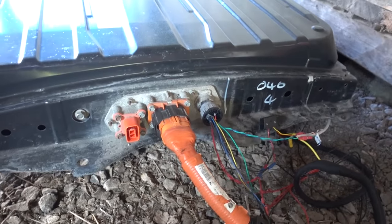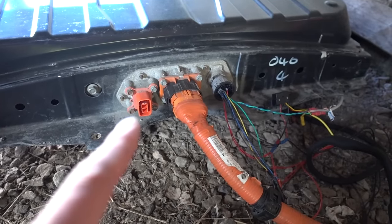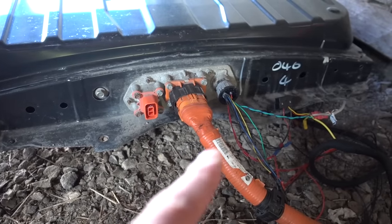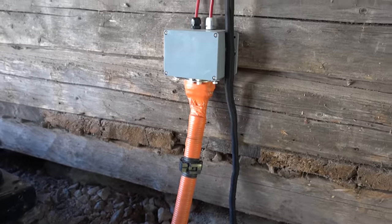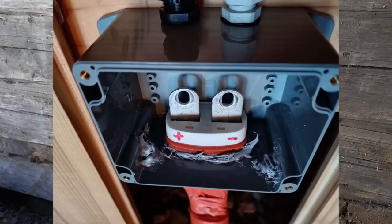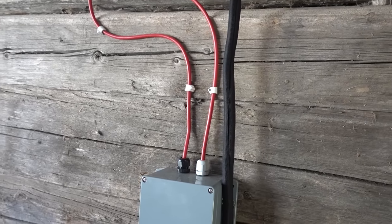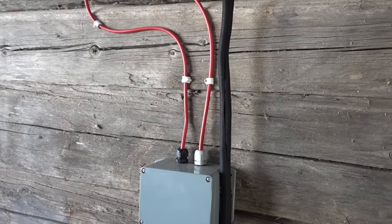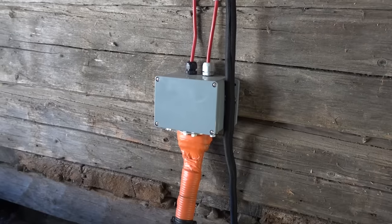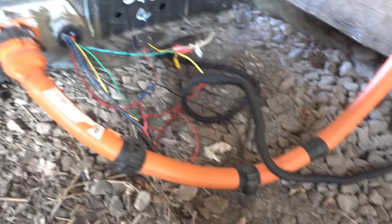So I have my battery here. It's hooked up to the main high voltage line. I had this wire already so I use this one, and this thick 50 square millimeter cable goes into this junction box where it gets downsized to 10 millimeter cabling. This is needed because the solar inverter only takes 10 square millimeters as a maximum. So this is just a reduction box.